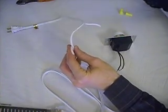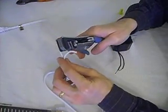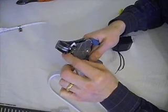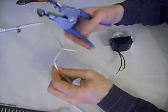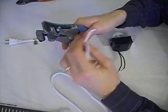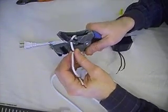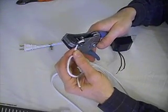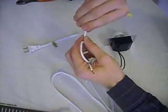I'm going to take my wire strippers now. I have got this little tool that will strip wires for me nice and easy. You don't have to have a fancy tool — a basic wire stripper or even just a pair of wire cutters can help you strip the wires. Strip it like that, take this side, and strip it like that. My wires are now exposed.